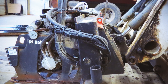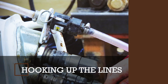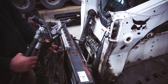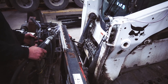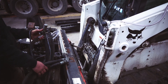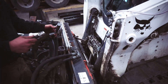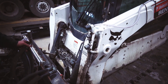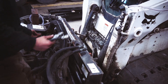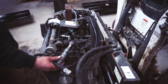As I said before, you're going to have three hydraulic lines in a high flow machine. One is going to be pressure, one is going to be your return, and then another one is going to be case drain, which is any excess oil that's not actually being used returning back to the system.